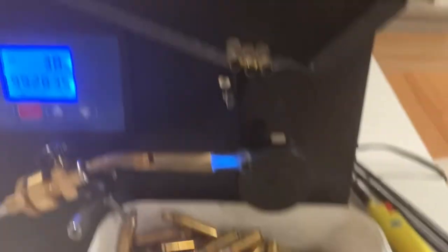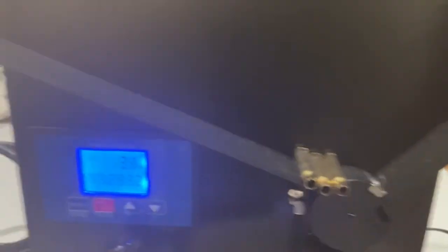If you have a shorter case and you're nuking it like that, that's what's burning your wheel. But if you turn it down to just like that, you see the heat going off to the side is minimal to none. You want it just about like that — maybe even less. It doesn't take much to anneal these brass cases.